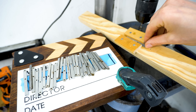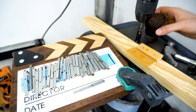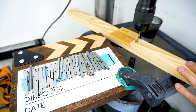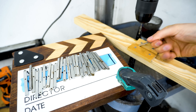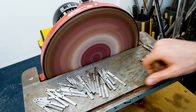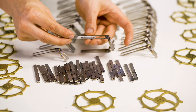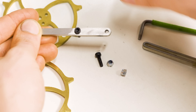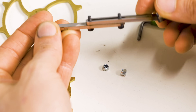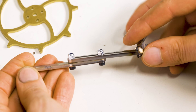To make this drilling go fast I made this little jig. I can take one of the parts, put it in here, drill the holes and take it out again. I'm going to use a lot of oil to keep the drill cold so it doesn't get warm and blunt. Even though I did my best I destroyed three drills trying to drill this stainless. I think the drill got blunt because of a combination of reasons: the laser cutting might have hardened the stainless steel, my feeds and speeds might be wrong on the drill press, my coolant is not cool enough, or my drill quality is cheap. I wished I would have thought this through more when I was designing — it's so easy to think you'll cut threads in those parts when you're behind a computer, but once you're faced with cutting 64 M3 threads in stainless steel, that task feels a lot more real. That's a good design lesson for me.